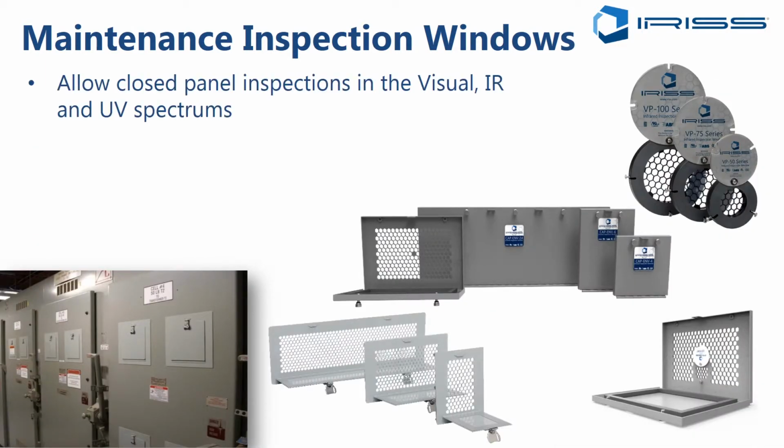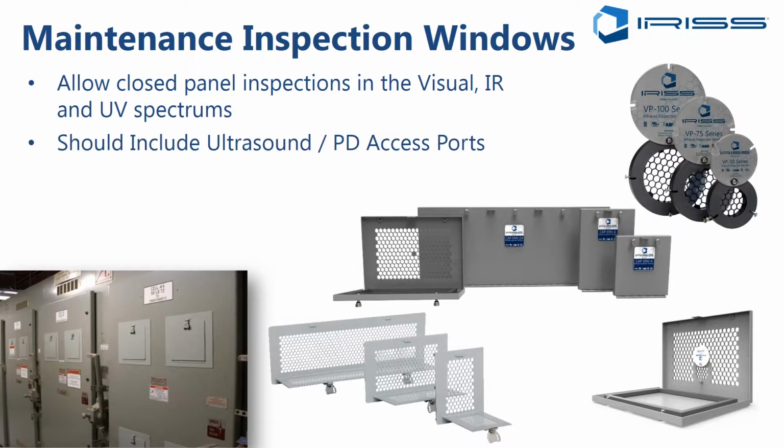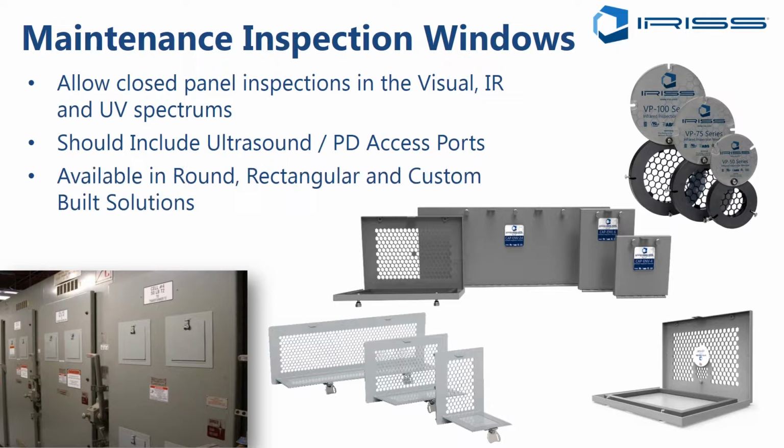So maintenance inspection systems allow closed panel inspections, and they should do so in the visual spectrum, the infrared spectrum, as well as the ultraviolet spectrum. UV can be used for detecting corona on medium voltage equipment. They should also, if the customer wants, include the ability to perform ultrasound or partial discharge access. And they come in different sizes and shapes. They're available in round, rectangular, and custom-built solutions.